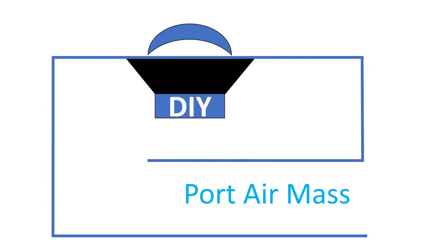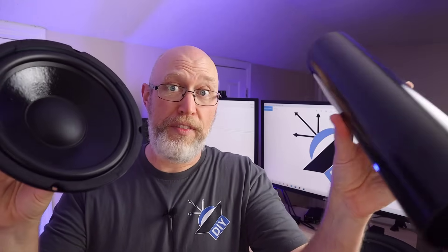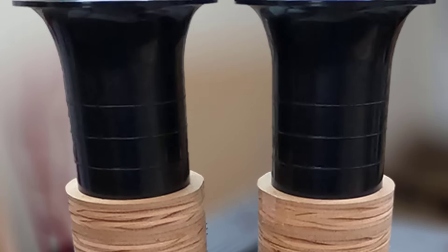While the air inside of the enclosure is decompressing and compressing, the air inside of the tube is going to begin to vibrate or resonate. So what you've actually got is a vibrating mass that's coming into contact with the air outside of the enclosure in order to create sound waves. The cone on this speaker and the air inside of this port are both vibrating masses that create sound waves. Think of this not as a tube, but as a bonus cone that's made out of air. Sound is just waves propagating through the air, and both the port and the cone vibrate and send these waves propagating through the air.